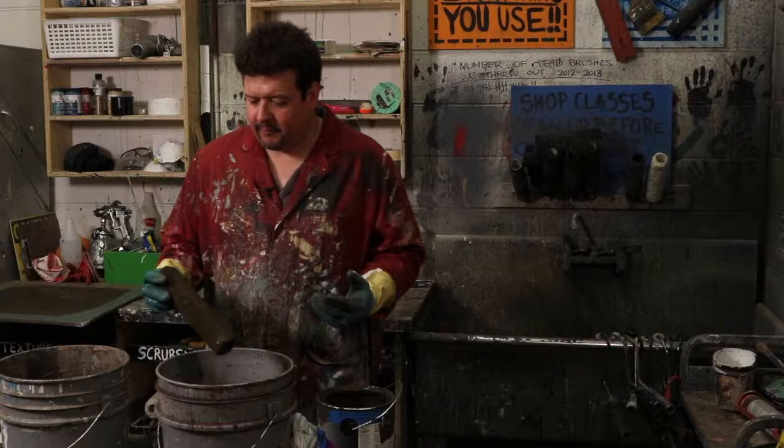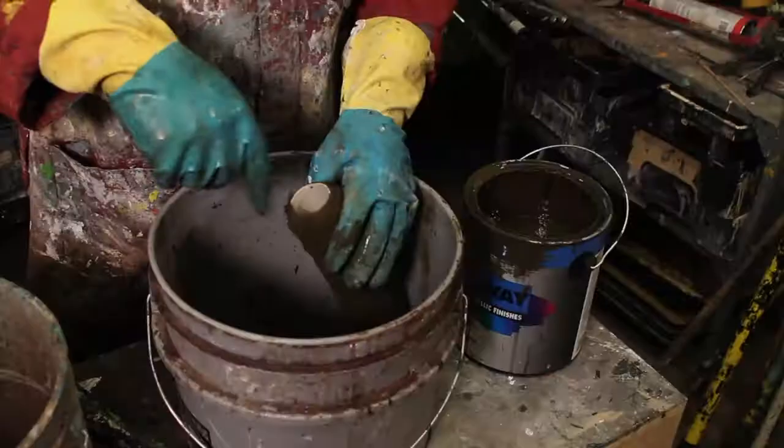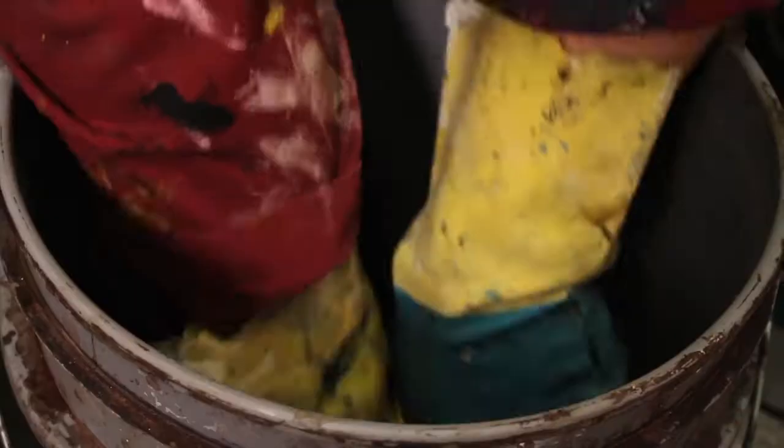Take the sleeve itself and immerse it in the dirty water and start washing it. Fill it with water and squeegee it as much as possible throughout the whole sleeve. Also run your fingers down inside it to wipe away as much of the paint as possible, keeping it inside the five gallon pail.